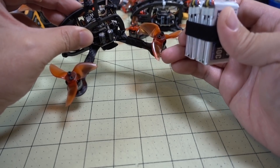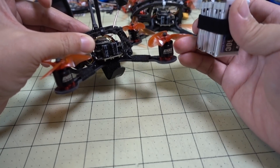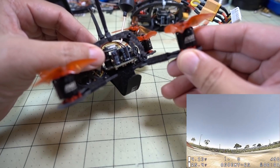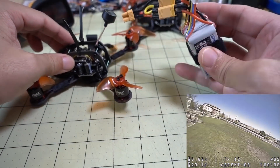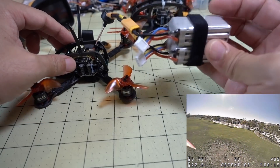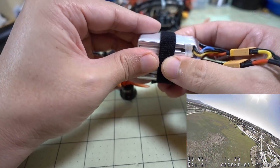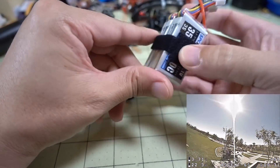I was considering trying a bigger prop, like a 2.5-inch prop, maybe at a lower pitch than these Avons. But I just don't think this particular 1108 motor is going to be able to handle that voltage. I may try a different motor, maybe like a 1304 or something like that. I think the biggest problem is going to be the batteries — unless I could find a 300 or 350 mAh that's an actual 6-cell. You could probably open one up and do all the soldering to make an actual 6-cell battery, and I was considering possibly doing something like that. But honestly, I think it's a little bit dangerous and I'm not willing to burn my house down for that test.